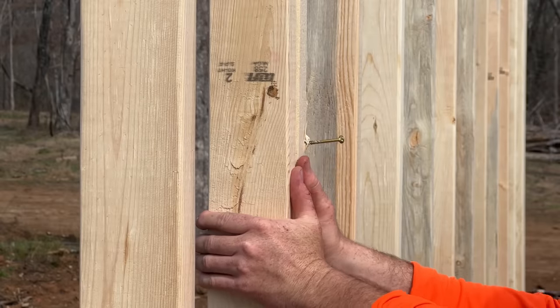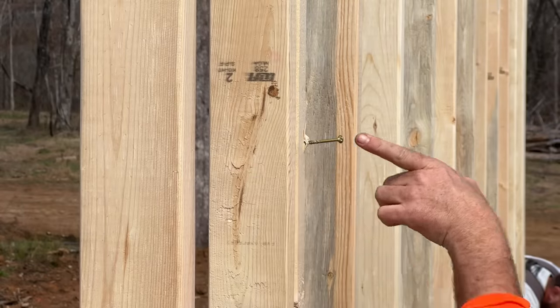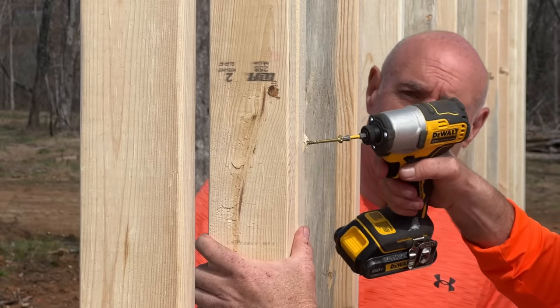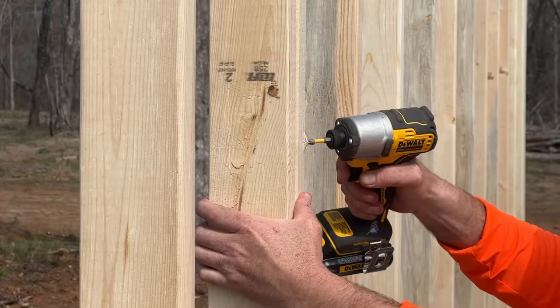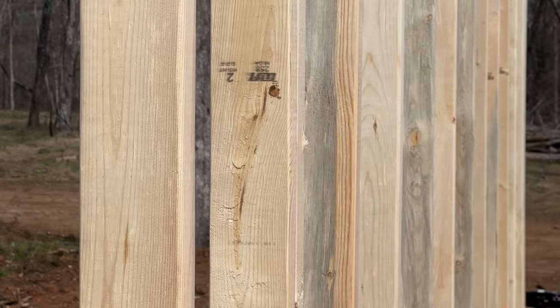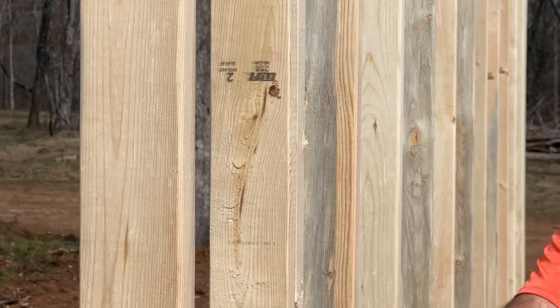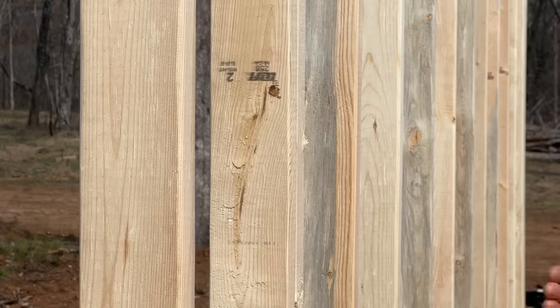These two walls are coming together and the plates aren't flushed up exactly, so I'm going to use a toe screw driven in at an angle. I've hit it once already and I'll hit it again right here. You can see it just flushes everything up really nicely — and that matters in the finish. Your drywall needs to lay flat. You don't want a wavy surface.